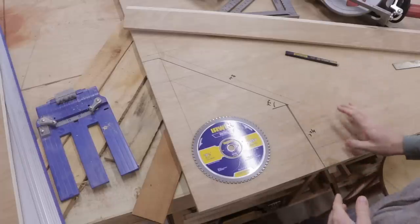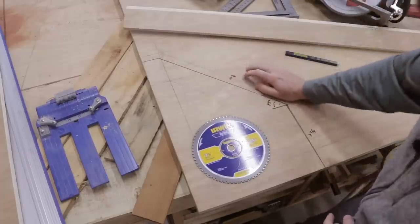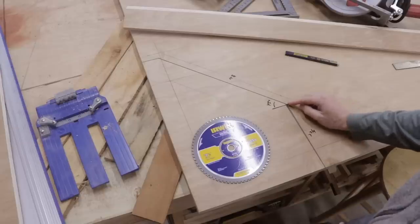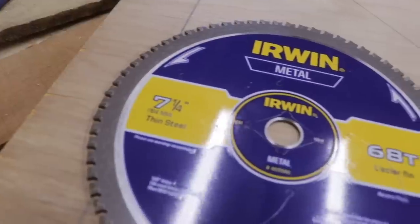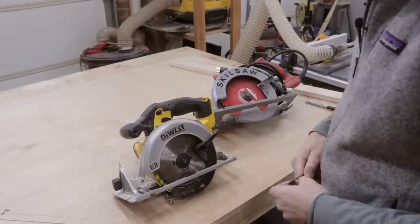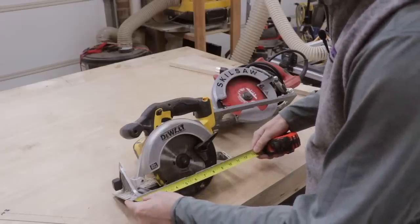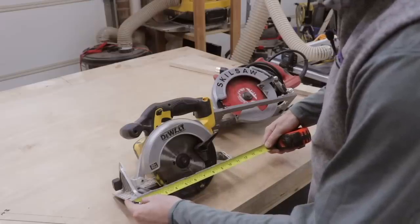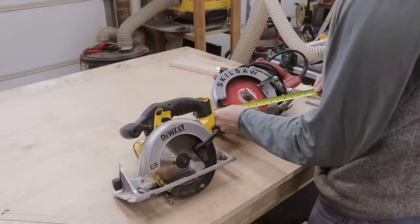After a lot of measuring of my saws, this is the size and shape I came up with. The top will be 14 and a half inches long, and that'll allow both saws to sit on top. The depth of the cabinet will be seven and three quarters inches, and it will allow a seven and a quarter inch blade to sit inside of it. If you're designing one of these cabinets for your saws, the most important measurement will be the length of the plate. For the DeWalt, the plate length is a little over 11 inches — 11 and an eighth — and the SkillSaw magnesium plate is 12 inches.